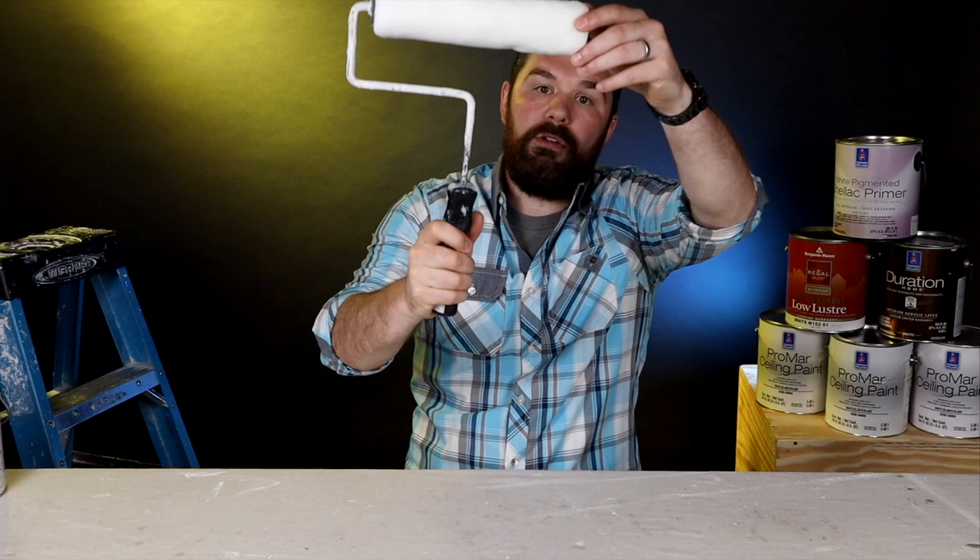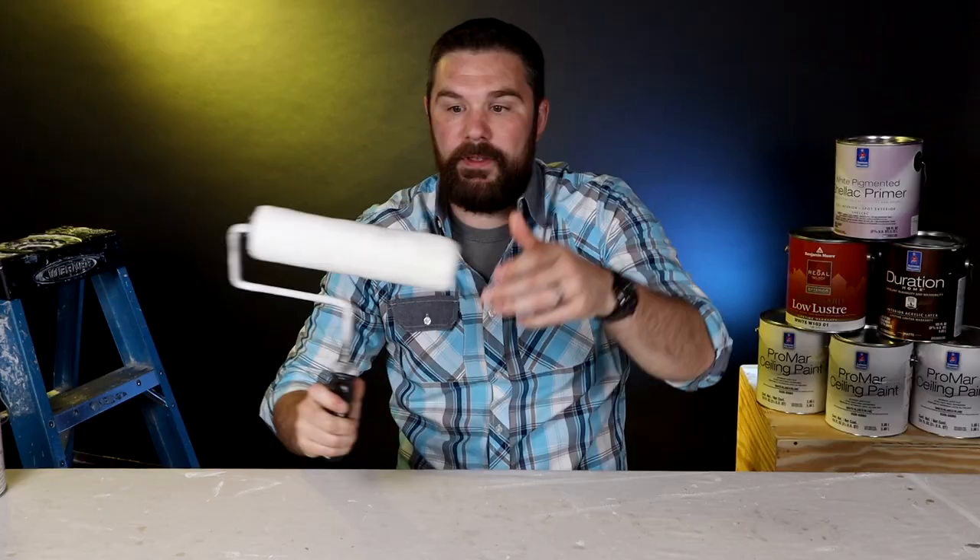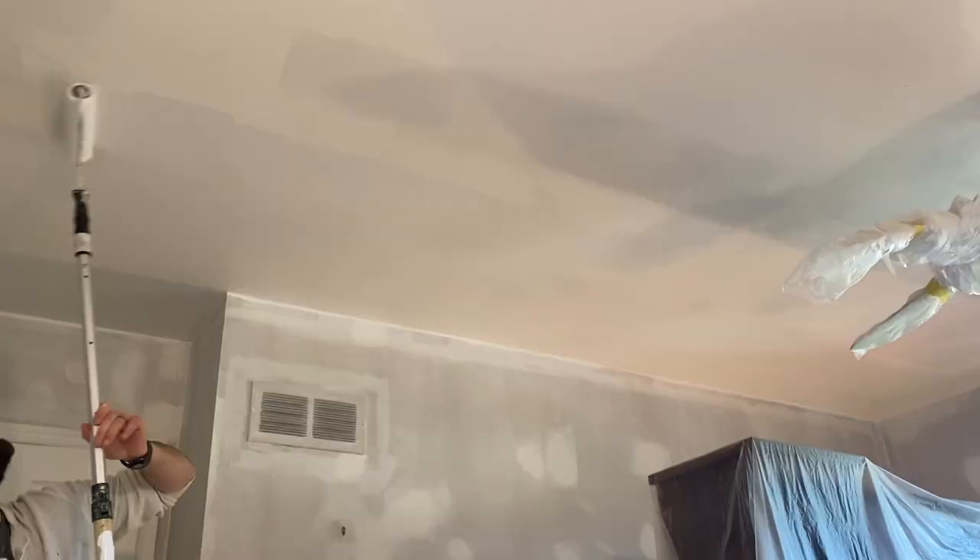Third is splatter. I don't like being absolutely covered in paint. There's no way to avoid a little bit of splatter because as you roll, the roller is spinning and you're going over top of yourself above you. Any little flecks that zip off the roller are going to hit the ground and you and all that good stuff, which is why you should be tarping off the rooms that you're rolling. There's no paint that's not going to fleck when you roll it, but the amount of splatter I've seen in some of these ceiling paints is ungodly. I just want a reasonable amount — nothing too crazy.